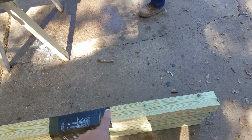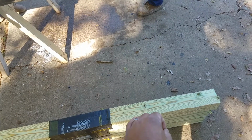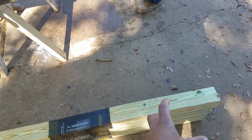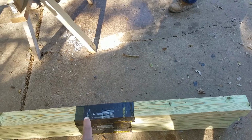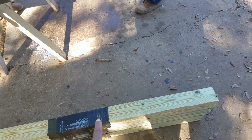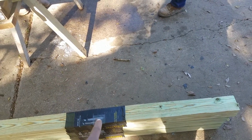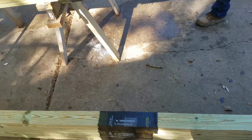Here, if you ever pull a fence post out, this is usually never rotten. It might be soft, but it's never to the point of just breaking over. It's always right at the ground level where it's at the point of breaking over. So that's why we don't treat the whole entire post. And the post saver sleeves are meant to be used in this application.